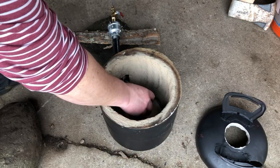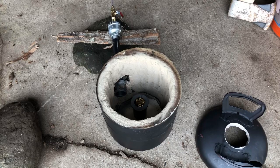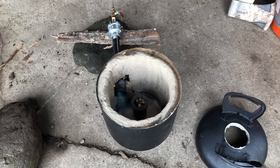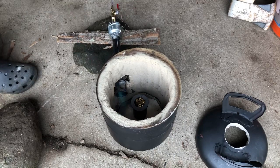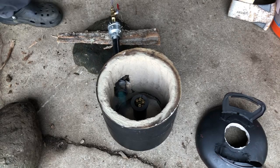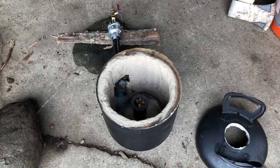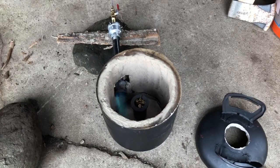Let's get this bad boy lit. We've got our small crucible full of scrap brass sitting on the fire brick base in the bottom, which works pretty well. The valve isn't very open yet, so let's give it some extra juice. Here we go — increase the pressure. It doesn't seem to be burning as hot as during my test. I wonder if my propane tank is running low. Okay, now we're talking — this thing is mildly frightening.